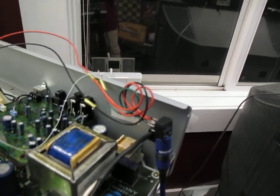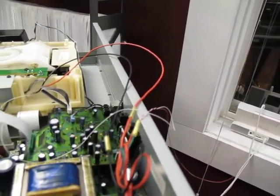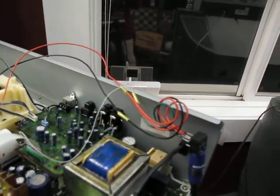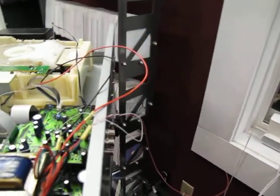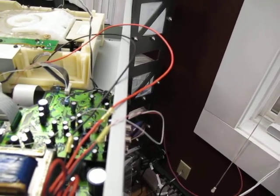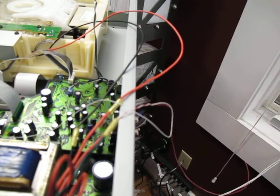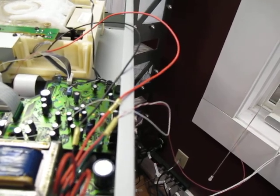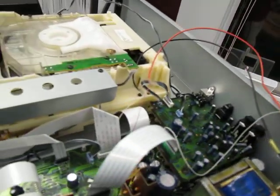This is something I picked up off of eBay. We can see wires going everywhere — there's a wire for power and a wire for ground. The particular unit I'm using requires a resistor; it calls for an 8.2 kilohm resistor, but I was able to make do with a 10 kilohm.